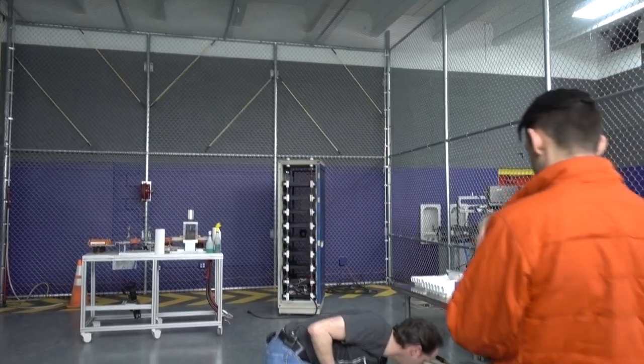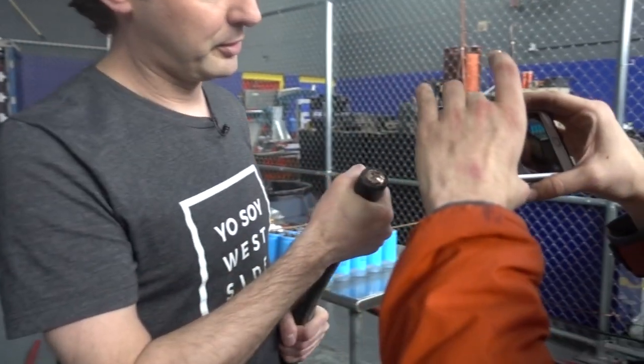So it's time, once again, to do a complete and total teardown. This will be its 11th, I think. I could be wrong, I didn't check the blog. But this thing has undergone like 11 major revisions. And today's major revision is on top of a complete teardown, rebuild, and cleaning. It's getting new main power rails, which are going to be quite substantial. Project Thumper has, pretty much since the beginning, used 250 MCM copper cable for the main power rails. We're upgrading that to 500 MCM cable, which is about this big. That's a 500 MCM cable.